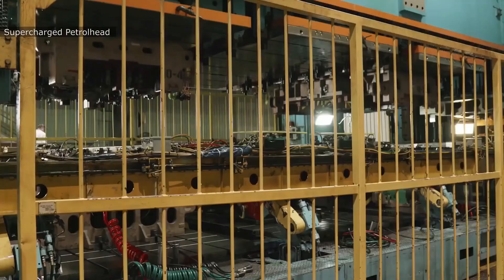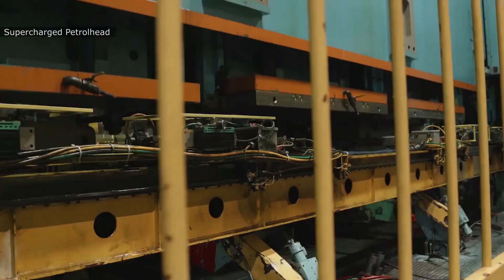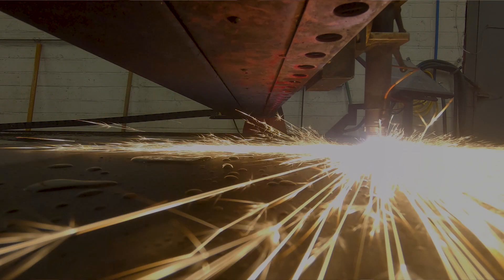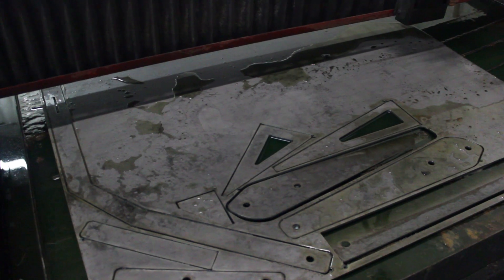If that happens, you have to go back to the initial stages and spend more time and money researching and redesigning. Large corporations like Honda, for example — their Design for Manufacture justifies the need for high-cost tooling for stamped sheet metal body panels because they're pumping out thousands upon thousands of cars. For this project, I don't need any elegant curvatures or sweeps because the cost of tooling and manufacturing would go through the roof. My Design for Manufacture method is to buy off-the-shelf parts, keeping cost and time down — and time is my main concern.